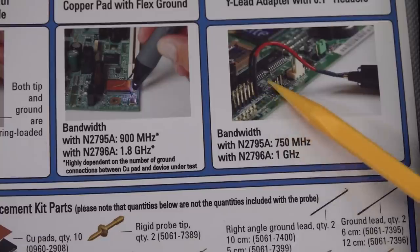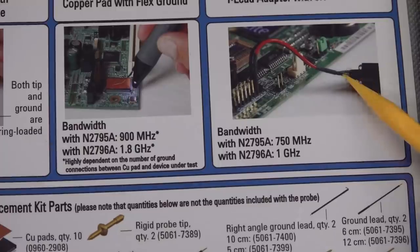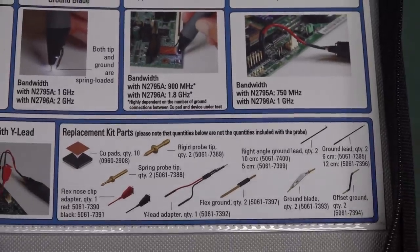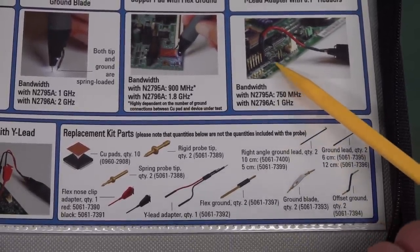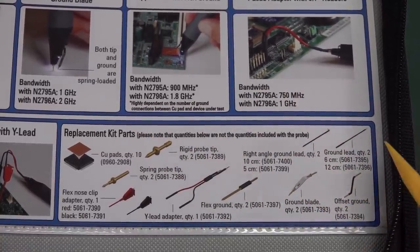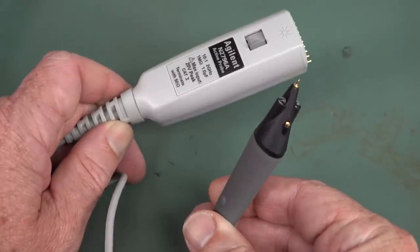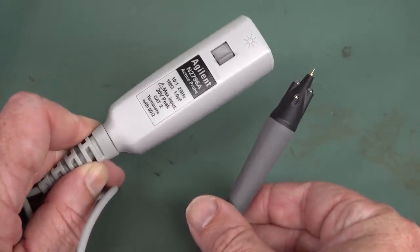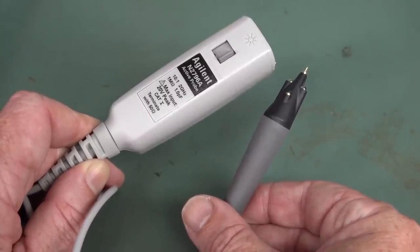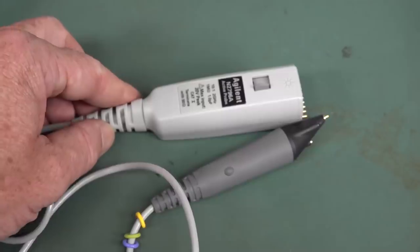You can put pin headers on your board for various test signals, with short cables that plug directly into your probe tip. A lot of designers will solder coax connectors directly onto the board so they can plug in their own resistive probes or active FET probes. Active FET probes are the Rolls Royce of oscilloscope probes — very nice, but you can roll your own with a bit of RG174 coax and get similar performance. These can't be beat if you've got the money.